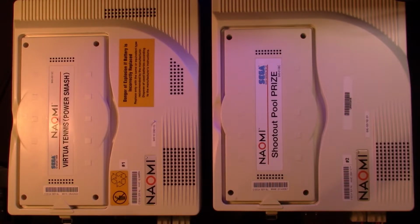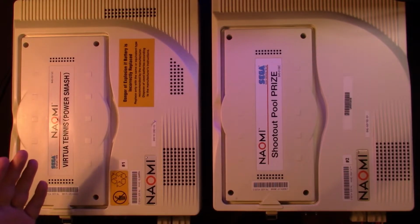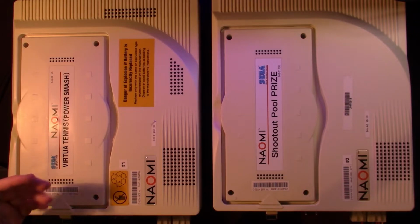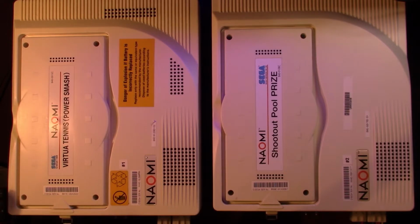So as regards the audio amp on number 1, I'm not quite sure what would have damaged that and why it failed. It's not like the memory chips that we had to replace in them originally, because it doesn't use the same 3.3 volts. But then again, you don't know what mistakes were made in wiring these up in the past, especially considering it uses the JST power connectors. So now that we're on ATX, that should kind of take care of things, as long as the user uses a reasonably modern enough power supply that's got enough power down the 3.3 volt rail. Again, Corsair, EVGA, Seasonic, any of the good brands will do.